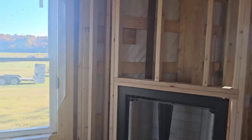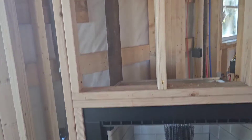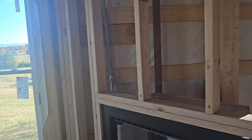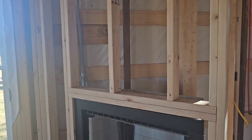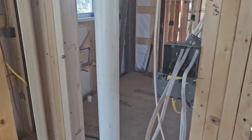Now this is one here I wanted to show you guys. He's run his SER up through there — do you think it's okay to have it in there? That's going to be up to the electrical inspector and the building inspector, but I'm going to say check your manufacturer's specifications, and the odds are yes, it's likely going to be okay to run back there. But work with your local electrical inspector and your manufacturer's specifications for the heating unit itself. That is not a plenum back there — it's not being used for environmental air.